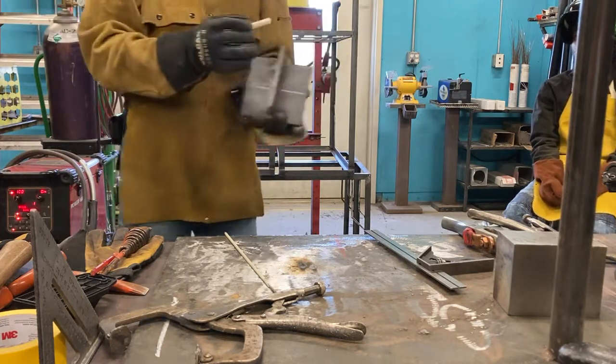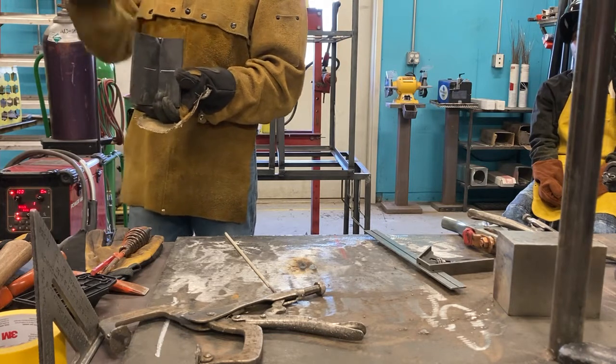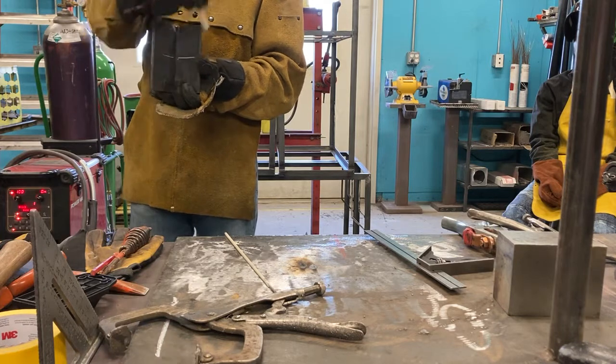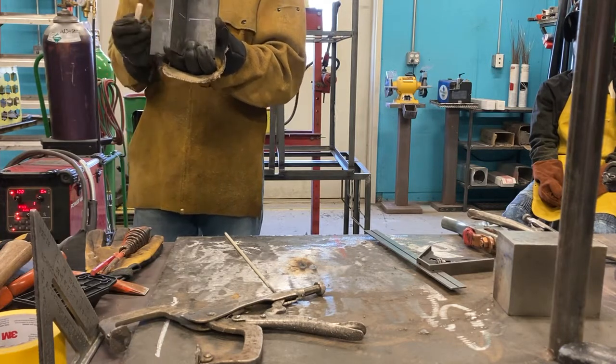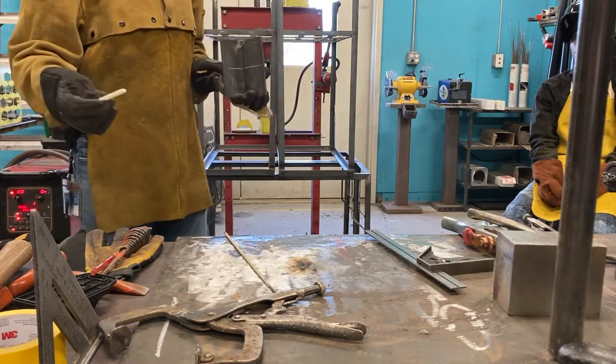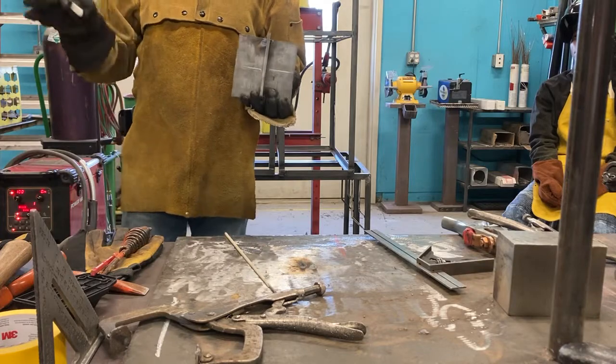Your lines should be exactly parallel to the edge. Parallelism. Your welds need to be dead parallel to the edge of your plate, perpendicular to this edge of the plate. Like think of Venetian blinds, just like that. It's gonna be tricky, but we can do it.